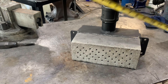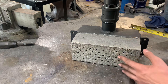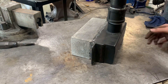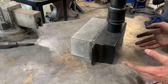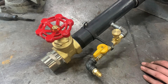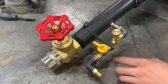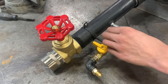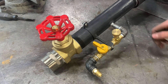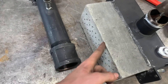The ribbon burner I'm going to be using is 10 inches long by 4 inches tall and it has 43 quarter-inch holes in it. The body of the ribbon burner is made out of 4x4 steel tubing with a 2-inch pipe welded onto it. There are no baffles — it just hits the back wall and disperses and mixes evenly. The air is being controlled by a 2-inch gate valve. The main gas shutoff is going to be a 3/8-inch ball valve, then to fine tune it, a quarter-inch needle valve with a quarter-inch pipe going right in. There's no MIG tip — I put a spiral mixer inside the pipe so the air and gas mix correctly and it burns evenly.